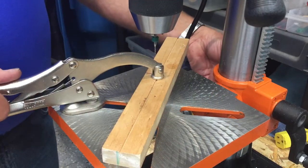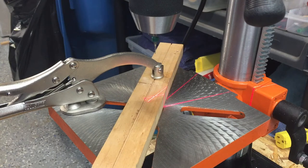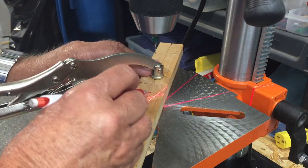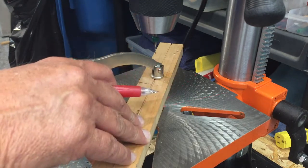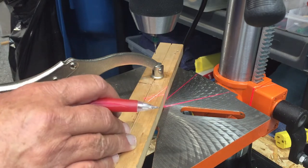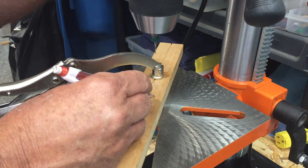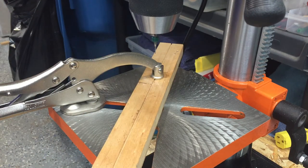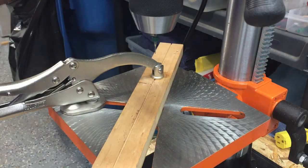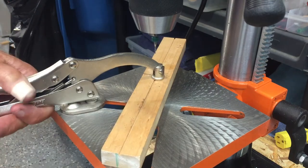Let me reposition the camera so you can see a little better. Before you start this process, tighten the table because you want it completely stationary. Because I'm going to be drilling with very, very tiny drill bits, I'd like it to be as accurate as possible. This is just slightly off. Part of the reason the laser runs on batteries is so you can adjust it with the unit unplugged — that's just for safety. My mark is just slightly above where the hole actually is, about the thickness of a human hair off.